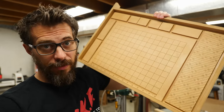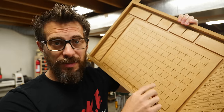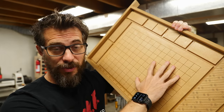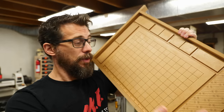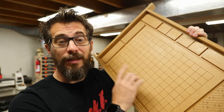I've got my mold all completed with several coats of finish on it. It is very smooth to the touch, but I can still feel the MDF a little bit through it. I think the best option if you want a fantastic finish on your silicone would be to make these individual pieces out of acrylic or something non-porous — that would give you a better finish overall. But this is where we're at, so we're going to go ahead and pour the silicone and try it out.